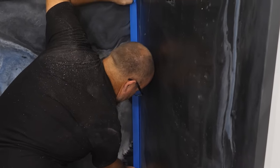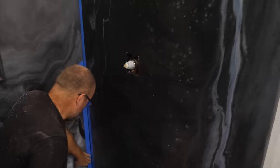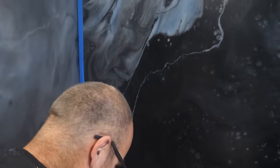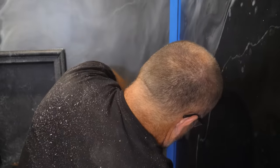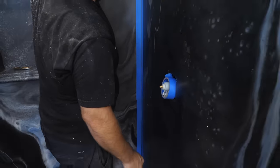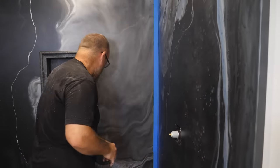And the nice thing about this is I don't have too many joints in this shower. I got two inside corners and I got my threshold. On the bottom, because we're so tight to the bottom, I'm gonna let the bottom be. And I don't think I'm gonna caulk or grout that, because that all flows nice and tight to the drain. And I'm waterproofed way past that drain. You notice I'm leaving about a heavy eighth, because I want that caulking to be able to get in that joint, and I wanna be able to peel that out without pulling out my caulking.